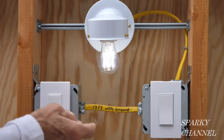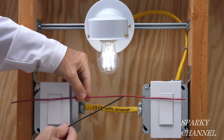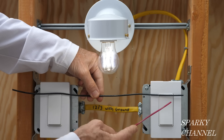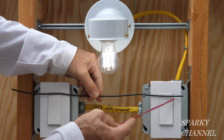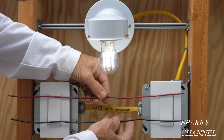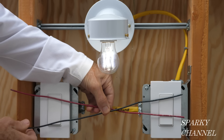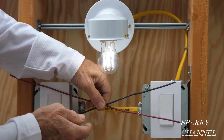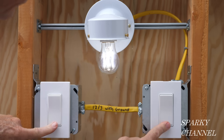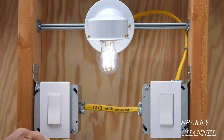That's how you tell it's been wired the way I like — straight across on the top and straight across on the bottom. You could wire it differently and get the same result, with a traveler wire going from the top brass terminal to the top brass terminal and so forth, but this is my preference. If you cross them — going from the top to the bottom and the bottom to the top — you're going to get a different sequence that to me isn't as logical. This way is much more logical: you press both the bottom ones and it's on, you press both the top ones and it's on, and the other positions are off.